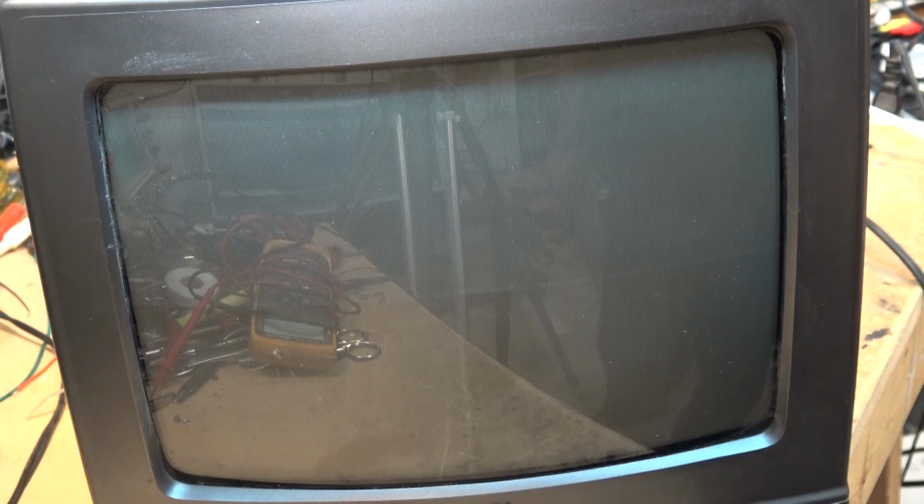And this one again has developed a color problem. So we'll turn it on here. I'm just injecting a color bar signal, and as you can see, I've got it going into my channel 13 modulator. But as you can see, we have a black and white picture.